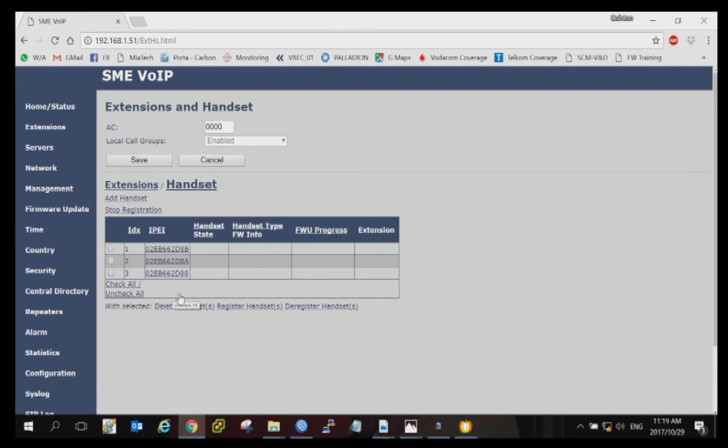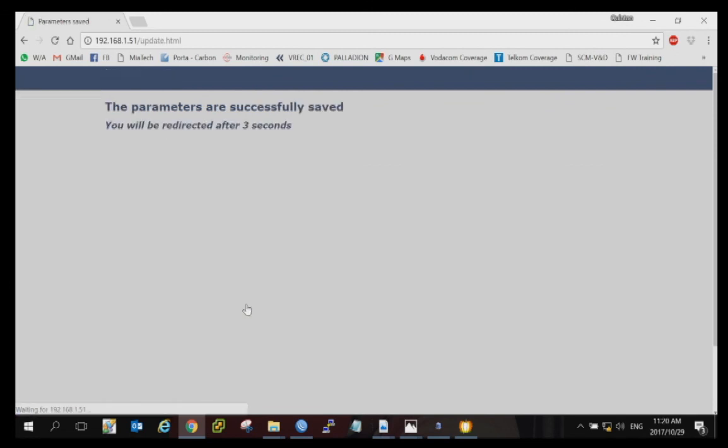Okay. So just press menu on your handset for now. Go to connectivity, say deregister. Enter 4 zeros, it deletes the registration. Talon, if you can just send another register handset request, and we just re-register them again. So we deleted the registration, just create a new registration, and let's see that it comes up again.